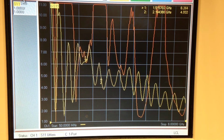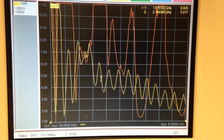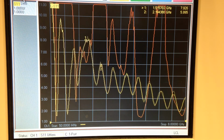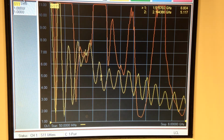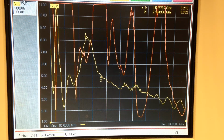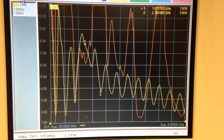So the problem is, how do you know how many sections you have to deploy on the thing? You may want to measure beforehand, or actually try to rig up a non-resonant piece of wire length on port 2 of the USRP and try to do a full half duplex, so we can receive on one, transmit on the other, and just adjust the whip length to maximize the signal. That would be a cheap way of doing it. Directional couplers, we can't get those to go from 200 to 6 gigs. 200 megahertz to 6 gigs is a pretty wide range. Not going to get that in a small package. So anyway, looks like it's going to work okay.